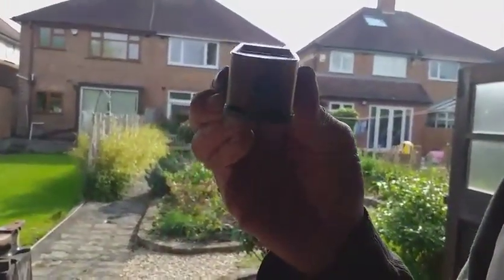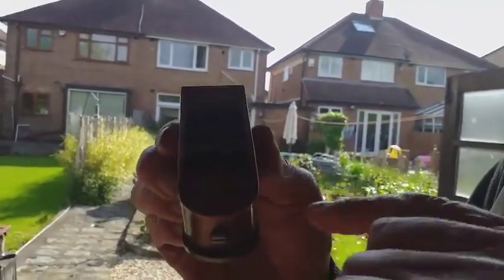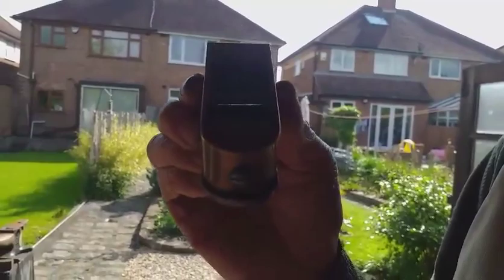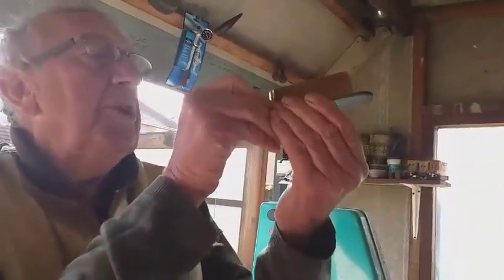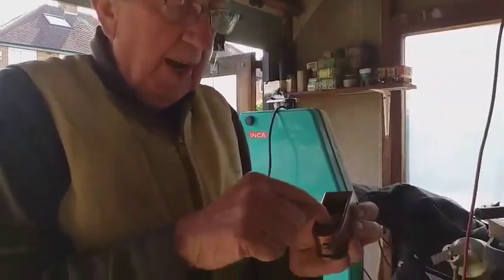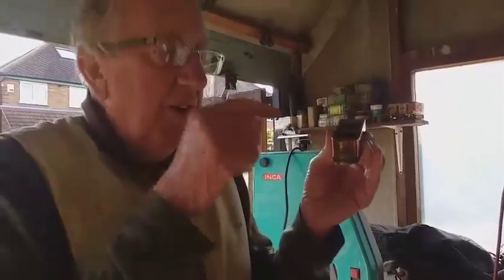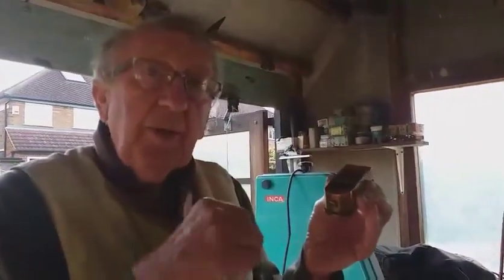If you move it around a bit, at some angle lining up the top of the bed with the mouth, you'll see a white line where the light's coming in. That is essential. If you can't see the white line when you hold it up to the light, the iron won't come out — there's something wrong with the bed. It'll either be a slightly too low angle than you were aiming for, or there'll be a bump somewhere in the bed and it won't be dead flat. So it's essential you can see through there before you've got any chance of the iron coming out.